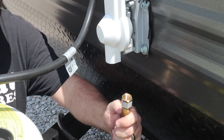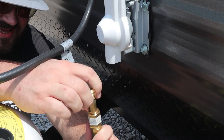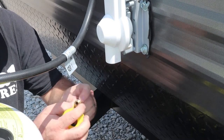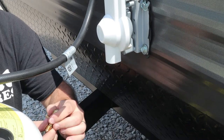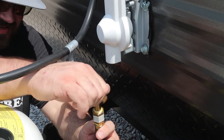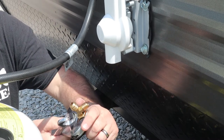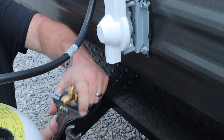The next thing we're going to do is install this T fixed junction — T connector. I'm going to put one layer of gas tape on these threads as well first. Again, just one layer — you don't want it too thick. Now we're going to screw this in into that coupler, all the way down. You want this nice and snug. I'm just going to take a wrench here and turn it, just to get it snug. That's plenty good.